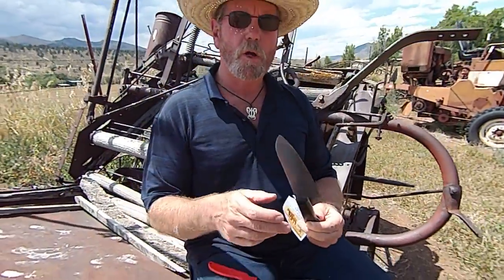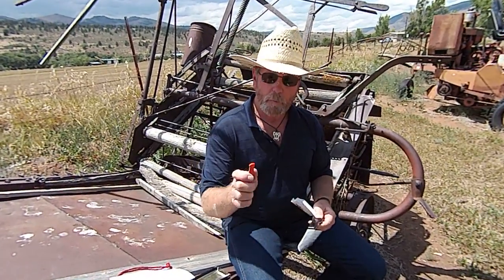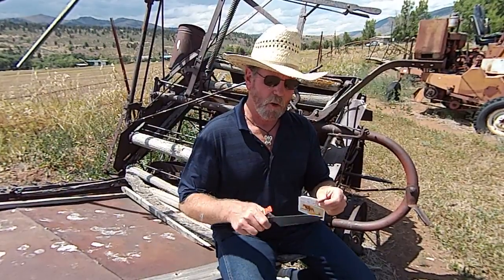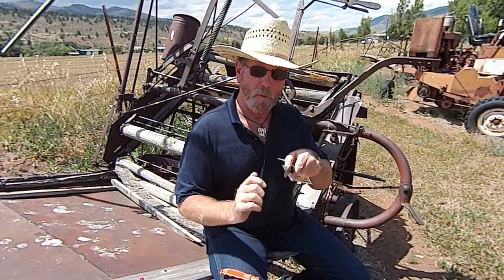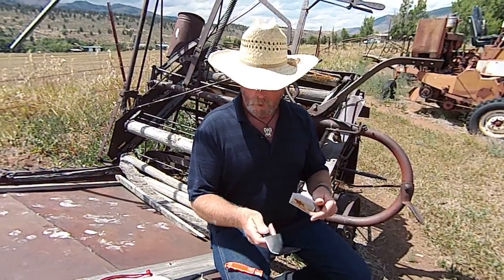Any knife can be made sharp, as long as it's not too thick and the secondary bevel isn't too thick. Tungsten carbide cuts the metal. A lot of people say you're just standing the fibers back up. No, not really. If you cut for a long time, your knife is actually going to be round and flat. There's no little wire edge to stand back up at all. Maybe after your second or third cut, you can stand some resemblance of a little wire edge back up. But if the knife is dull, you actually have to sharpen it, take some metal off. So that would be this one.